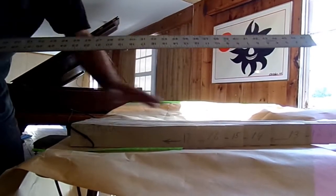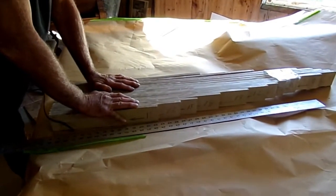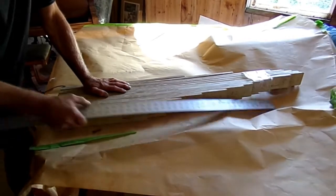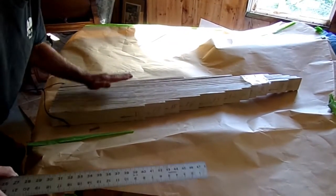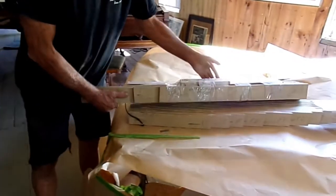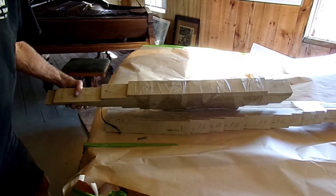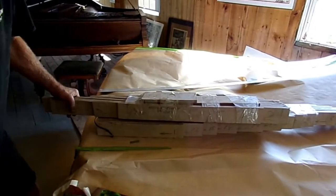So these are made one by one, and after they're attached to our press base, the soundboard press base, we shape them into a bowl by hand with an abrasive like this into the dish, so that each one of them is beveled correctly to fit the face of the board. And we can save these, and we can actually make it a little deeper if we need and use these over again. Here's another set, for a Bechstein that we just did. We delivered this, I don't know, last March, a year ago, I think. May 26, '15. That's when I pressed it.